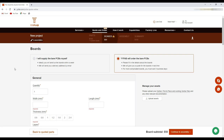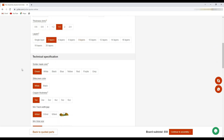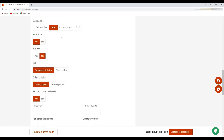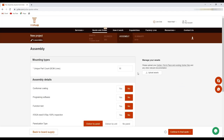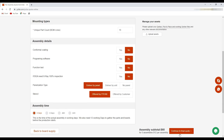At this page we will need to set parameters for our PCB. The width is 100 mm and the length is 90 mm. The thickness we want is 1.6 mm and our PCB is double layer. We will choose the black color, and all other things will remain the same as shown here. Now we will click here and it brings us to a new page, where after checking all parameters we will click here.